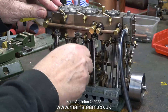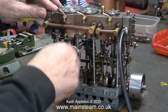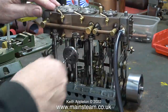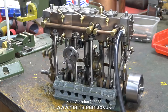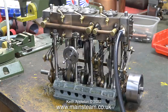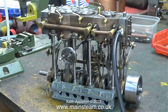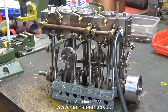In the next episode, I'm going to look at the valve timing of the low pressure cylinder. I'm winding the handle, which moves the expansion links and allows the engine to run in the other direction. With the expansion links at this end, it's still a bit lumpy. This is largely due to the fact that the centre drop arm is a bit loose on the reversing shaft, which means the valve timing of the intermediate cylinder — the one in the middle — is slightly retarded. I put this right in the next episode. The slop on the linkage that controls the valve timing of the middle cylinder is not a problem when the engine is running in this direction.